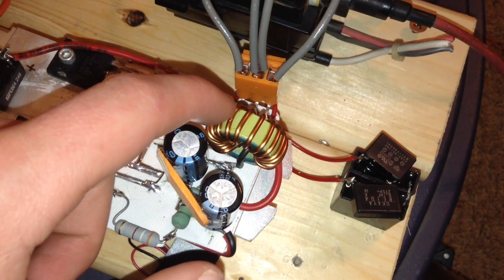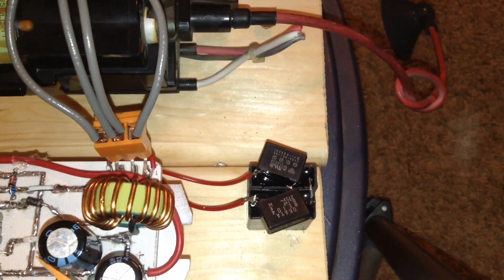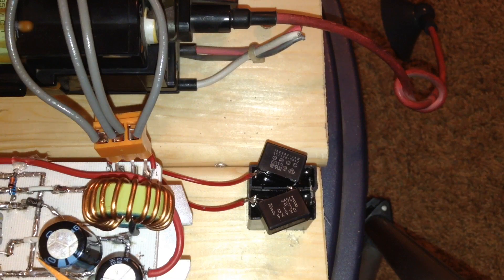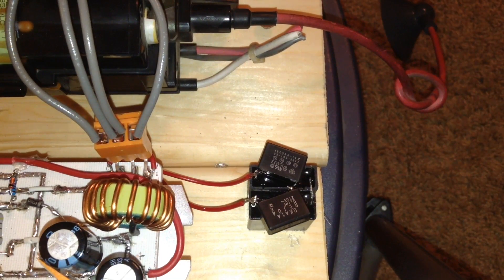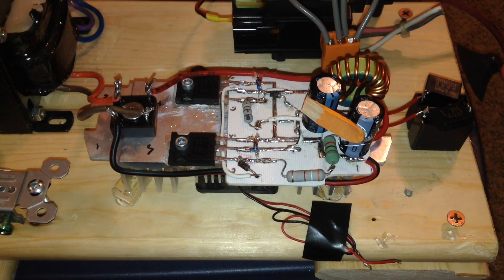The inductor is a high amperage inductor found in a computer power supply. These two capacitors down here were found in a variety of different electronics, and I had to use lots of different capacitors to create a 0.68 microfarad capacitor with enough voltage rating to supply my needs. These capacitors get hot, so I'm going to have to either put them on a heat sink or add more capacitors to create a larger 0.68 microfarad capacitor, because they overheat so much that they melt the hot glue holding them to this wooden piece. The heat sink that these are mounted on was found in an old computer graphics card.